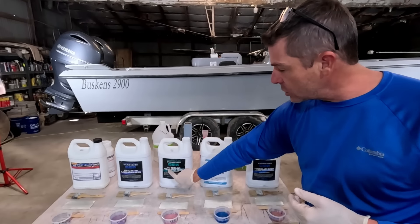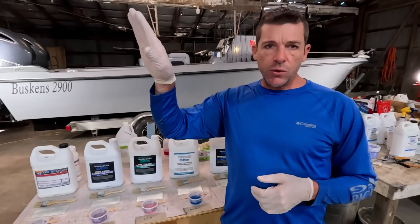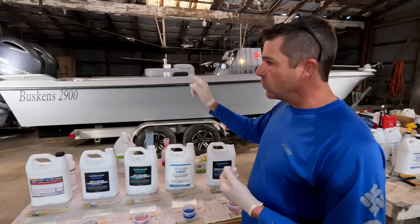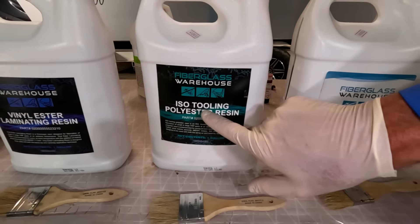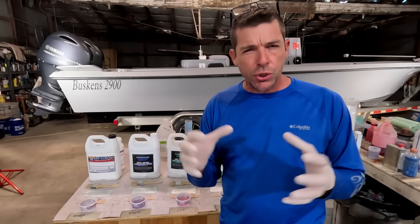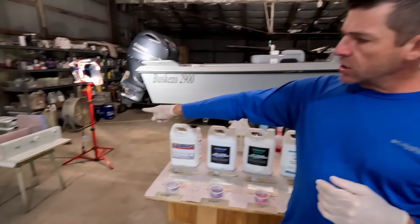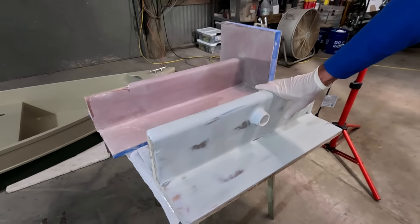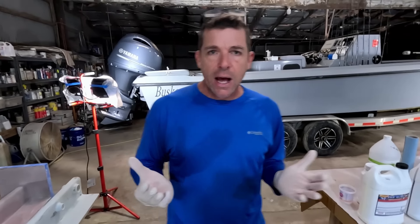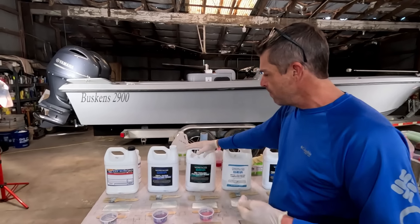Moving up we've got an Iso Tooling Polyester — ISO stands for Isophthalic — and it's moving up the food chain a little further. That is actually what we built our 29 out of. The designation 'tooling' refers to building molds or forms; it's good for that because it's a low-shrink resin that doesn't move or distort much when it cures. It's got really good bonding characteristics, and in our how-to fiberglass-over-plywood demos we used isophthalic resin. A little more expensive but just better overall properties — though you're still in the polyester family.